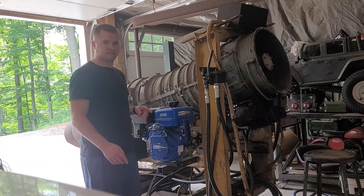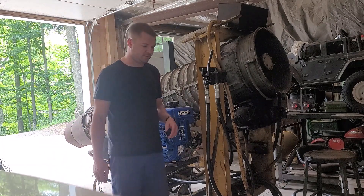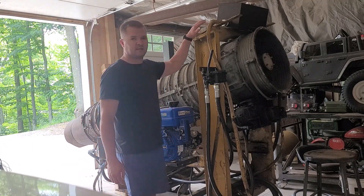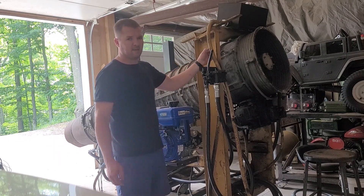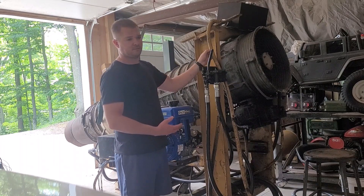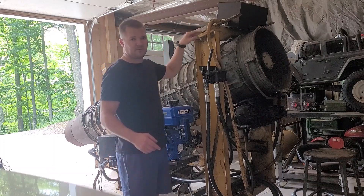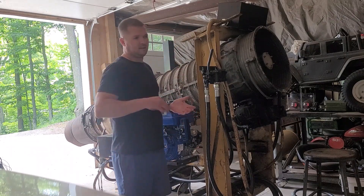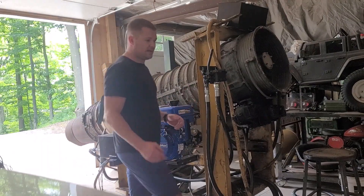The tach is working, so that's one piece down. Next is to build oil pressure to make sure the bearings are lubricated before messing with the fuel system. I mounted the oil tank up high to help pull fluid into the lines — once the gearbox and oil pump get some fluid in there it should prime itself and keep running. I'll run it through a few startup cycles to get some RPM in it and keep trying until we see oil pressure on the instrument cluster.